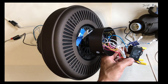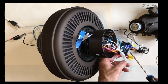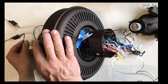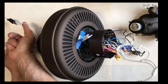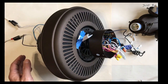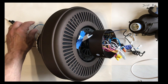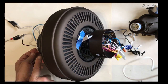Later on we'll take a look at the schematic and what's going on inside this fan. On the top side of the fan we have three wires coming out: one is a blue wire, and we have our white and black. The black and white will provide power to our fan motor, and the blue will provide power to our light fixture.